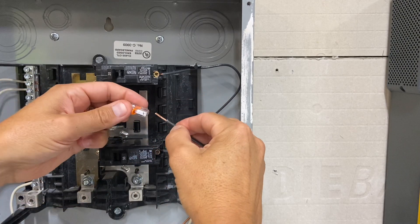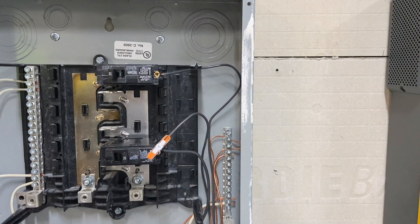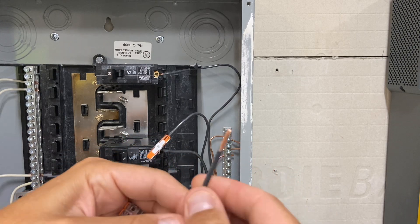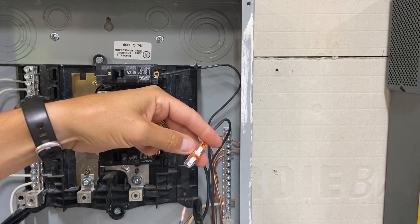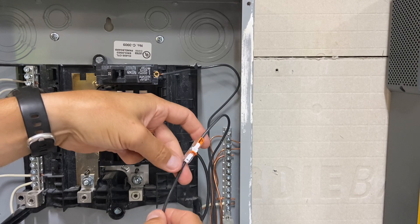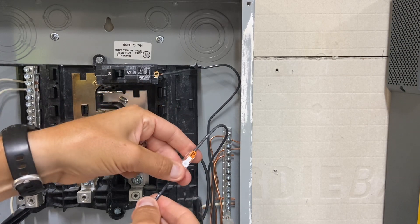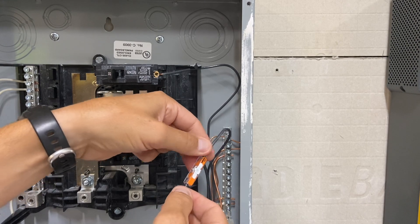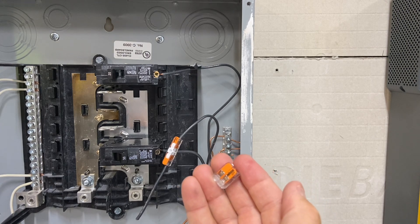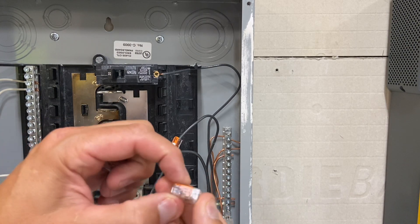Your fridge wire is still tied in down the line, and then you're probably going to end up using stranded 12-gauge wire — a lot easier to bend through the conduit into your critical loads panel. This flap goes up, and you'd insert a 12-gauge stranded wire going into a conduit to your other panel. You'll clamp it down, and once it's all the way in you'll know it — they do not tug loose, they don't wiggle. They're really awesome, the Wago connectors. These are UL listed also, so just make sure you check what gauge they are. This model goes from 24 all the way to 12.